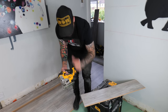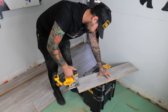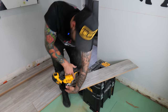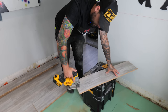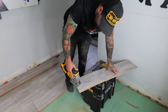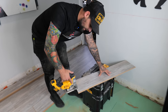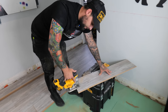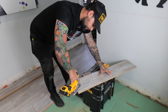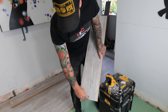We're going to cut this out with a jigsaw set to zero. Slowly work your way through and when you come to the bend stop trying to push forward and slowly start to turn - no rush. If you're not comfortable with the jigsaw you can remove the piece and come in from the other side to make your life easier. You'll be left with a nice rounded off corner - plenty good for the pipework. Slide that in.